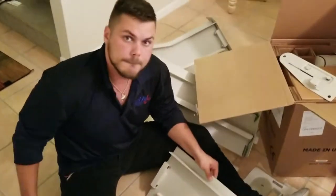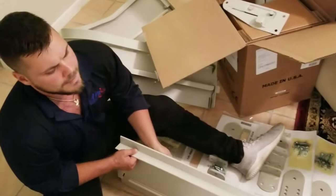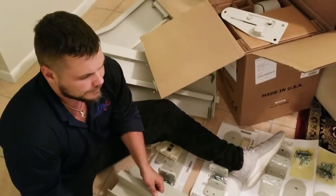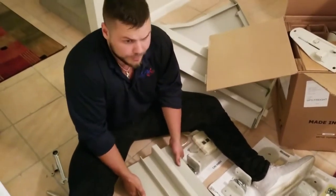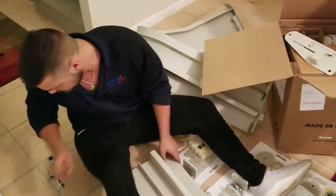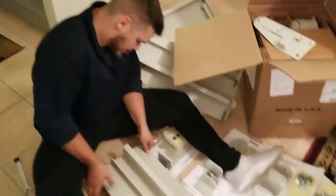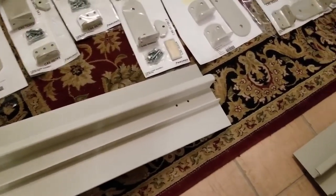On a scale of 1 to 10, how easy is it to remove those shipping brackets? It varies, because it seems like some can be loosened by hand, and others you have to torque pretty hard, so it's pretty inconsistent. And what size socket are you using for those? 17 millimeters. 17 mil. He's got the bracket off of this one. He's got it off both rails.